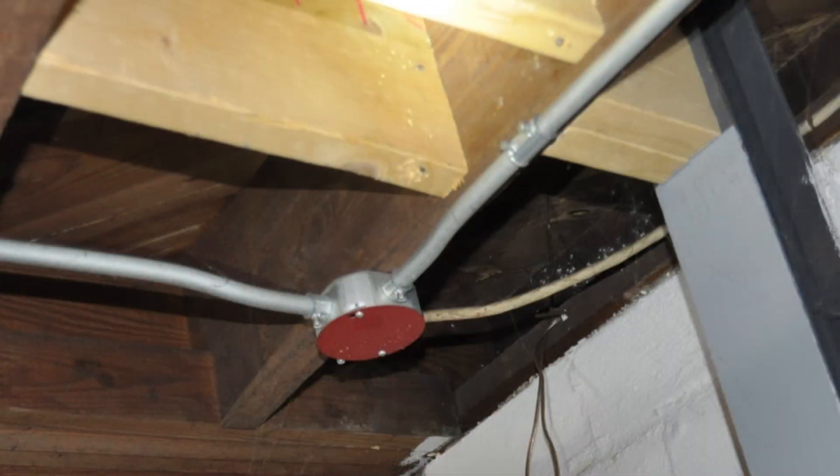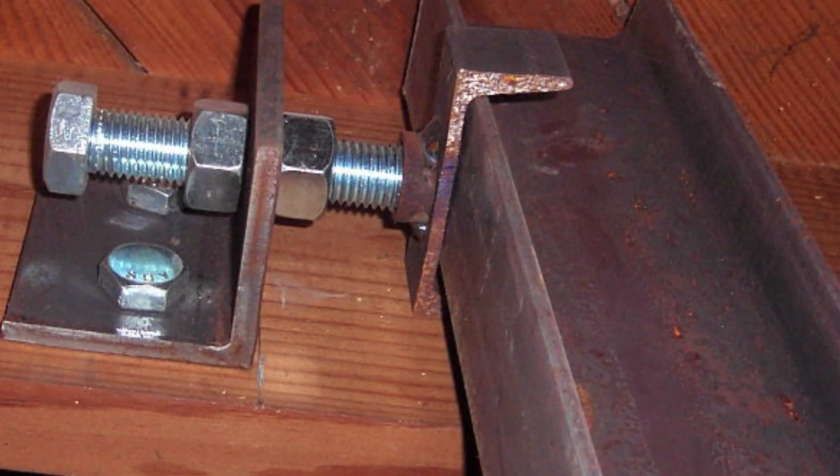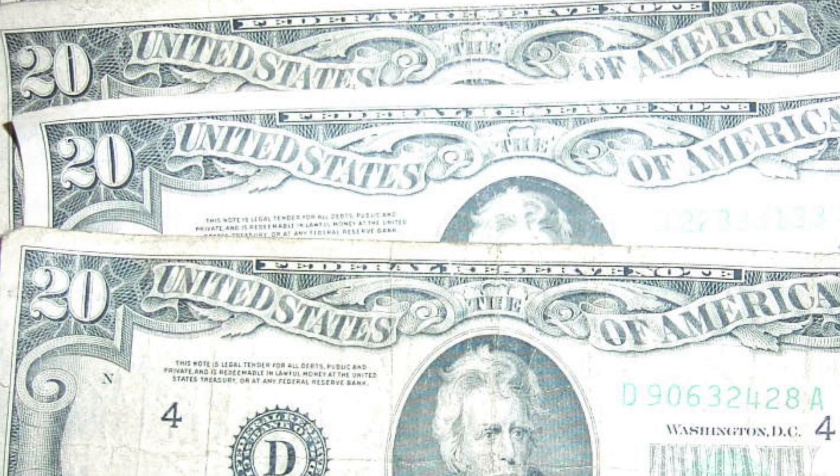The proper way of re-supporting a wall would be with vertical I-beams. The I-beams generally need to be put in the ground — you can cut the concrete and put them in the ground on a footer, and when you pour the concrete back on the basement floor it'll pin them. Then you need to re-support up in the joist so you can transfer some of that loading to more than a couple joists, and then you may have to shim it on the back wall.